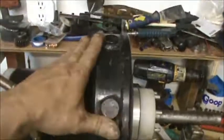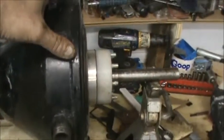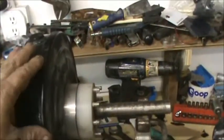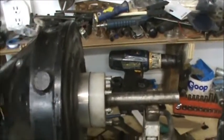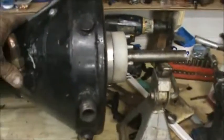Here's another problem I ran into in this area: it's creating a huge vacuum, but there are some major flaws in that. Because once it starts to spin, it actually creates an air pocket that contaminates the oil and causes it to cavitate — which produces multiple bubbles — and then it basically cancels itself out.